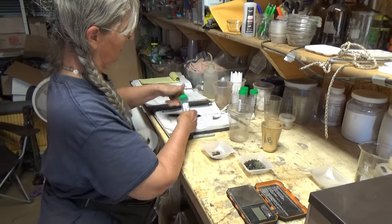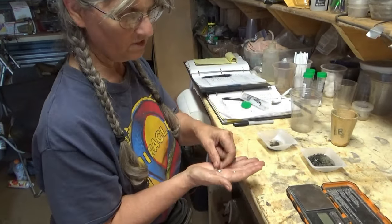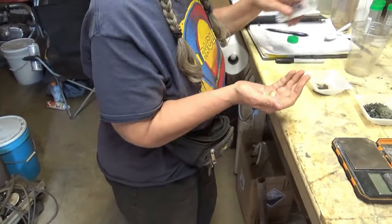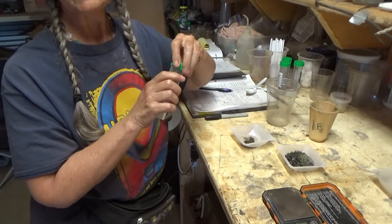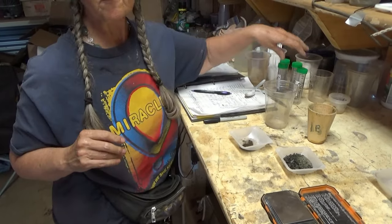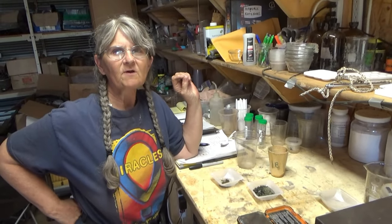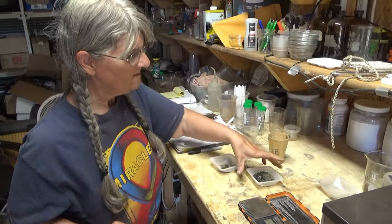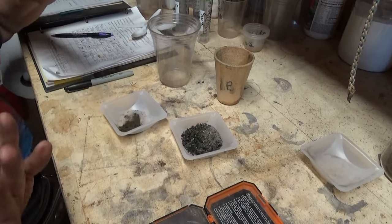Normally when we've been smelting this, for the amount of debris we usually get, we usually get beads about that size. Last time we got an outsized bead — the fusion did not act normally when it was going on in the furnace, and the button was extremely brittle and fractured when I brought it out of cupellation.